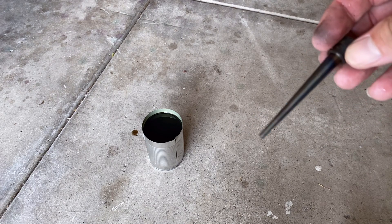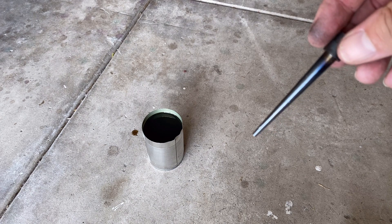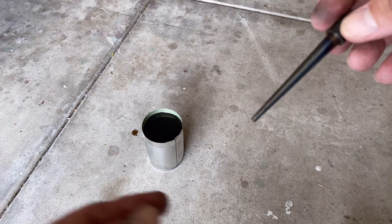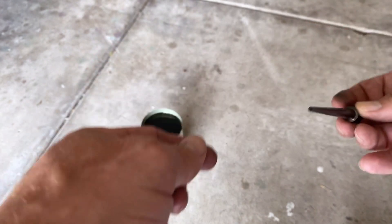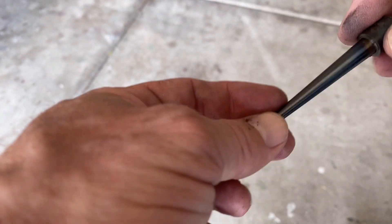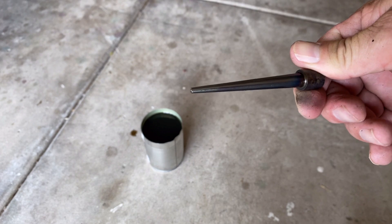See the blue color — before we polish it. When we grind it, we're going to grind half of this away, and from the end it'll be a half-moon shape. That's what we call a single flute reamer, or a spade cutter, or a half-moon reamer, or a backbore tool.